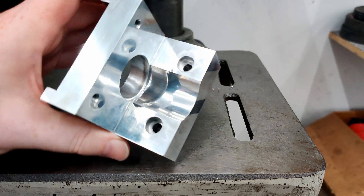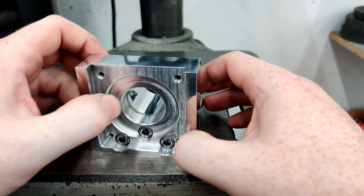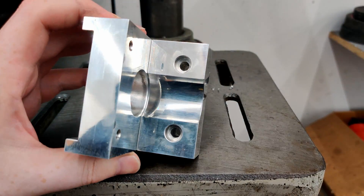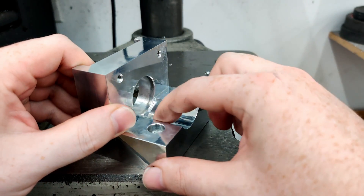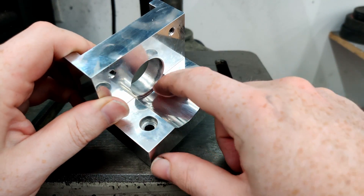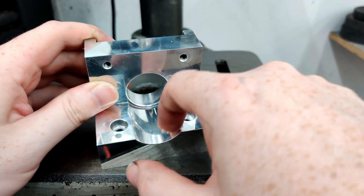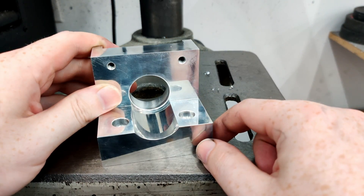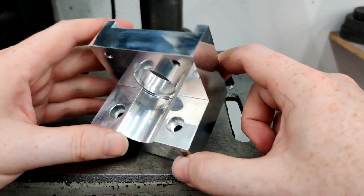This video is finishing up with making this part for the y-axis. I do have to make another one of these, but this is how the first one turned out. I'll primarily show the machining of this part — it was a 3D pocket, then a parallel pass with a ball end mill, and also a parallel in the opposite direction with a roughing mill just to get a little closer. Seemed to work fine, and now I'll cut to the video.